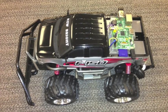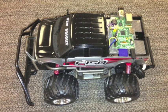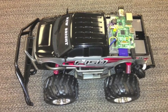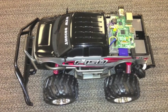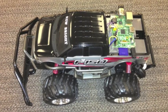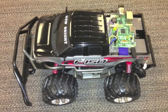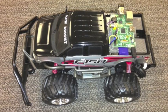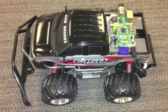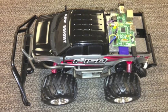There were a couple of challenges we had to solve. The first one was the battery — it carries its own little cell phone charger battery. The truck itself has a separate battery that helps it travel back and forth. It has a Wi-Fi card, a tiny dongle, that allows it to connect to our server. And we have the GPIO controlling three things: the first is the lights in the front, second is turning the wheels left and right, and the third is moving the truck forward and backward.